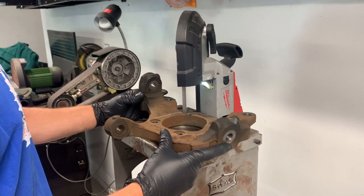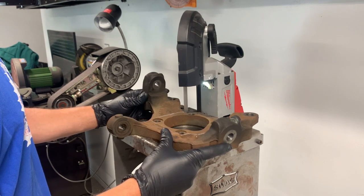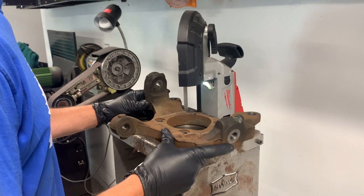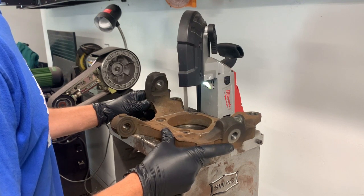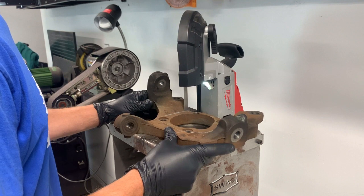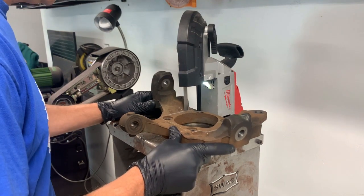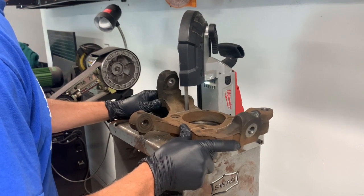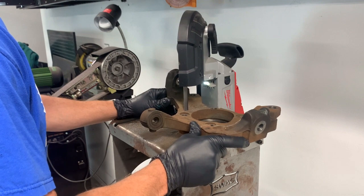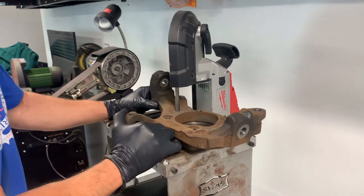Here I go again with bandsaws — I love bandsaws. They just work so well. The thing I find, and nobody told me this before, it's just what I found after using them, is that the difference between a bandsaw and a circular saw or cold saw is that they resist building up heat. The saw has so many more teeth going through the part and they don't build up heat. I've got other circular saws and abrasion saws — they build heat and then just stall out the blade, and the bandsaw just keeps grinding through. This is a Milwaukee bandsaw in a Swag mount, and I'm using a foot pedal. I'll put a link in the description for all those things.